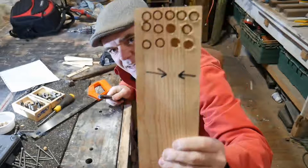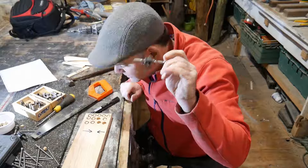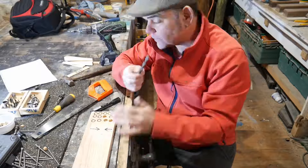It's definitely worth doing, and it's so easy to get yourself a set of plug cutters and these countersink drill bits with the clearance — this is a 10mm one, available in various sizes. There are other ways of doing this, but they aren't as good. If you haven't got the right size cutter for the countersink hole, you can use a 10mm drill bit — but I don't recommend it, it doesn't work anywhere near as well.